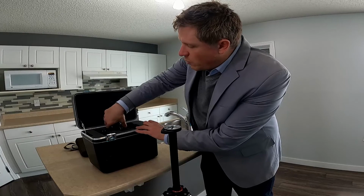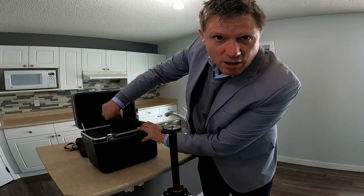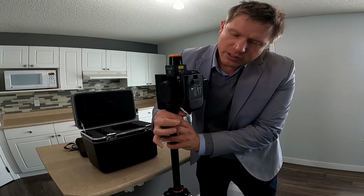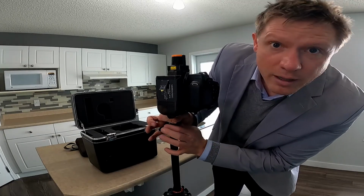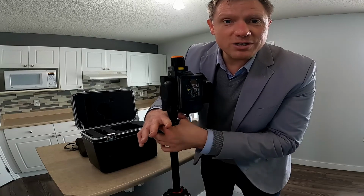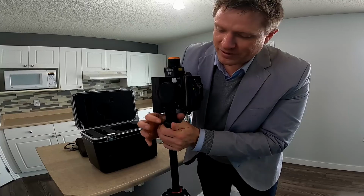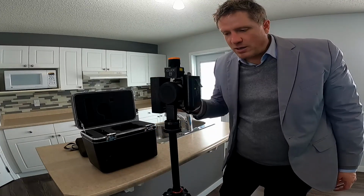Now remember, when we're pulling this out of the box, we're grasping it by the mounting pillar there, that really solid piece of metal. We're holding it firmly. Now what you can do is you can just move it. And I don't know if you can see, there's a little knurled ring there. You can turn that with your thumbs, turn it clockwise. You'll feel it tightening onto the tripod there. Make sure you're holding that camera firmly until you can feel that it's tightened onto the tripod very well, okay? Double check that it's well tightened onto the tripod. Now we're ready to get up and get going.